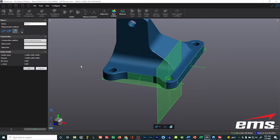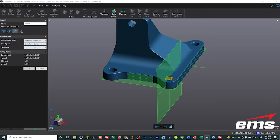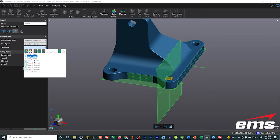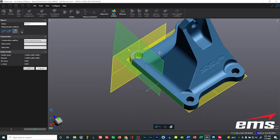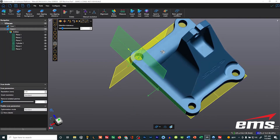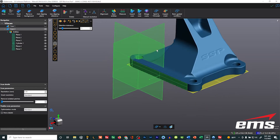For the normal, I'll select the reference plane here — it's going to use the center of that cylinder axis as my plane, and this plane as the normal vector. That's why I built those reference planes. We'll do the same thing again on the other side, picking the cylinder as the point and plane three as the normal vector. So essentially what I've built are three planes: the bottom of the part, a plane centered one way on the hole, and a plane centered the other way.